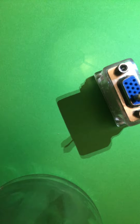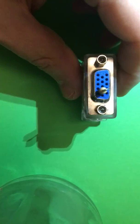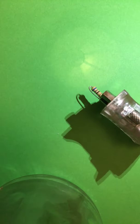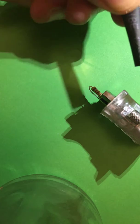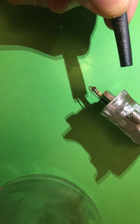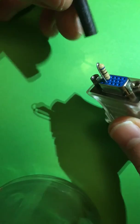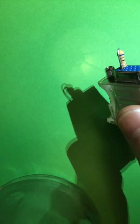I've got a little bit of heat shrink here. Heat shrink tubing has a temperature rating on it — this one is 125 degrees C, so in order for it to shrink properly I need 125 degrees C. Let me test that on the resistor. Yes, that will definitely cover it. I could probably go a little bit smaller than that.